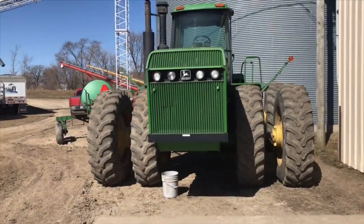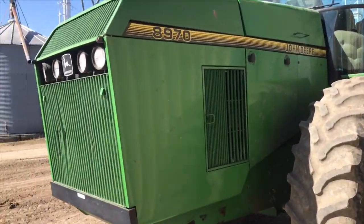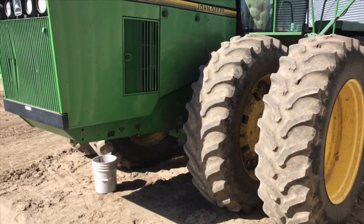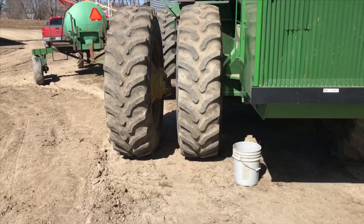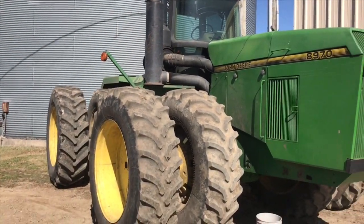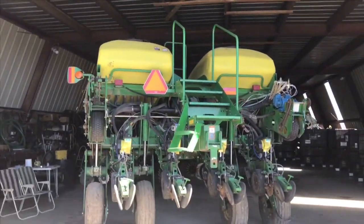This thing needs an oil change on the engine oil. They're coming out to charge the air conditioning system. We got the new motor pump right here — got that in there. Then I'd like to get that mulch finisher folded out and have that guy put those gussets on the other side and beef it up. We got a couple shanks that need some attention — they ripped through one of the bolt holes. Those front ripper shanks need a little attention. Get that thing greased up, looked over, tires checked, because things are coming fast.